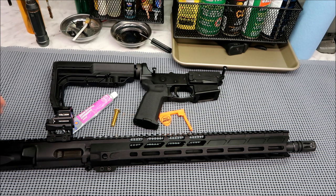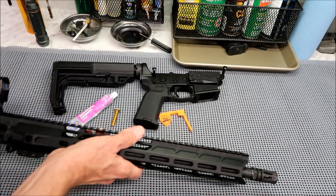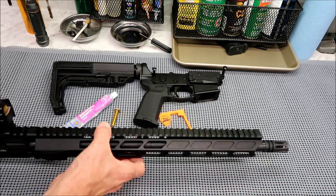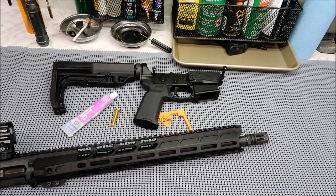Problem was I didn't have the pilot for the 9mm barrel, and neither did anybody else. So the next day I stopped by the gunsmith down the street from the office. He looked it over, agreed with this same thing. He says, yeah, that crown's not gonna work. And you don't want me to do it because it's going to be $125 and I know what you got in this gun. So I said, yeah, you're correct.